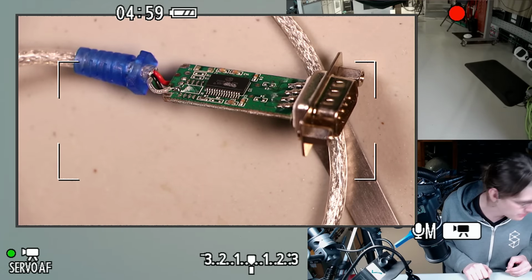So this VFD, being that it already has a built-in serial interface and everything, we just need 3 wires. We just need ground and 5 volts. They both need to be able to carry a decent amount of current. And then our fairly pokey 19200 baud full-strength RS-232 serial connection.